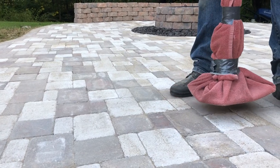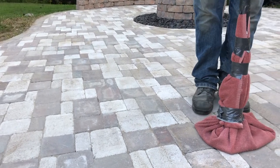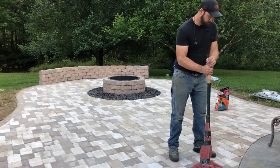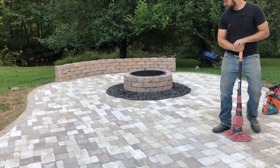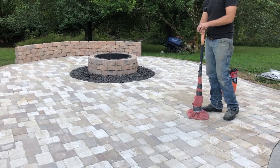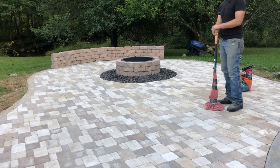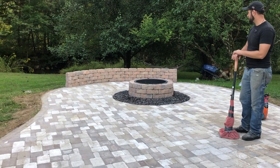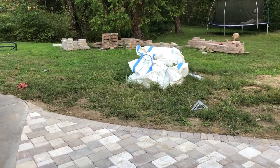The project took so long that we'd stop here and then start there the next day, and it would have rained, so we had some that had to get pulled back out and redone. If you look, this one might be just a tiny bit high, but give it a couple of good bumps and it does two things — it vibrates the sand down further into the crack, and then you can set them. It looks really good; the wall looks great and the black lava rock looks so good over there on the fire pit. So we get the sand in, spray it with water — it glues them in place — and then put cleaner on the pavers, and then put our chairs out. We still have to build the wooden top for the seat and the boxes where the firewood will sit, and then we'll do plants all around the edge next spring.